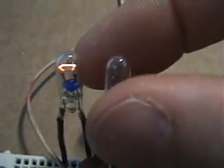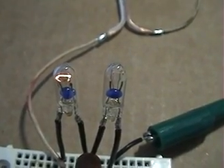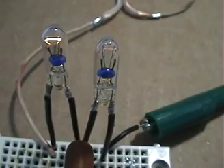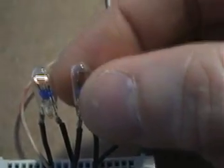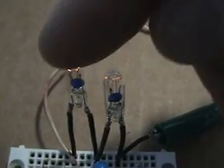With 0.01 microfarad it's just glowing a little bit. Let's go up to 0.026 microfarad. Insert that — and look, the bulb that was glowing with 0.01 is now out. So again we have a benefit. Tune to get the bulb glowing just a little bit again, and this one's getting stronger. Take that out and do another step up to 0.047 microfarad — stick that in and it's extinguished again.